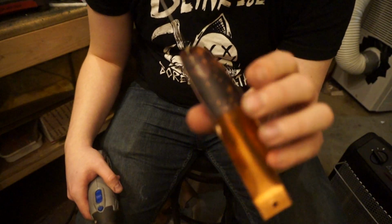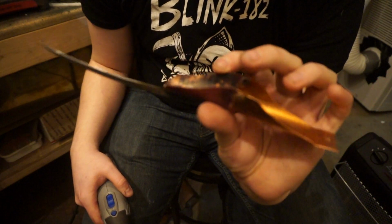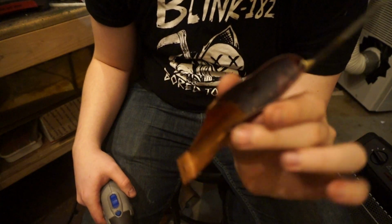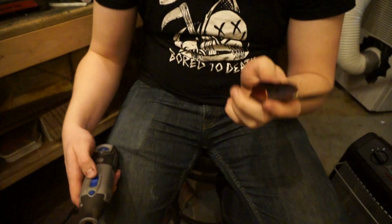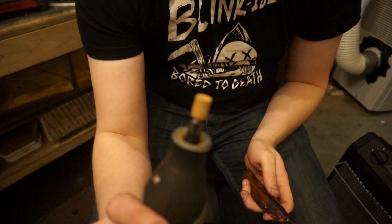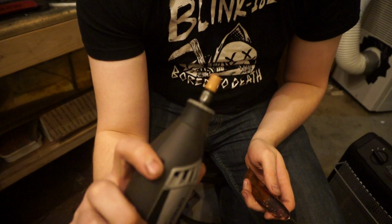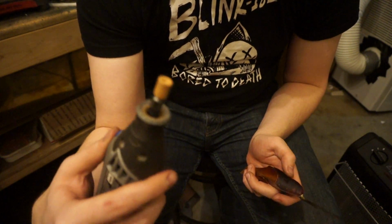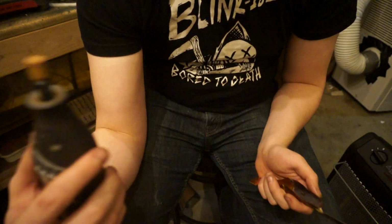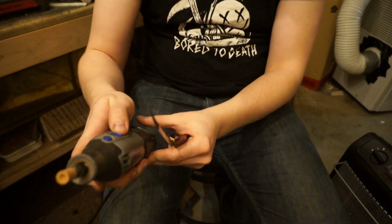When you braze a tip, you'll probably get a lot of dark on the inside that solder doesn't really like to stick to. So I'm going to grind a little section for the solder to stick to with a stone Dremel bit. You could just sand it away too, but this is just faster. But sandpaper works just fine too. I'm going to put this on the lowest setting.